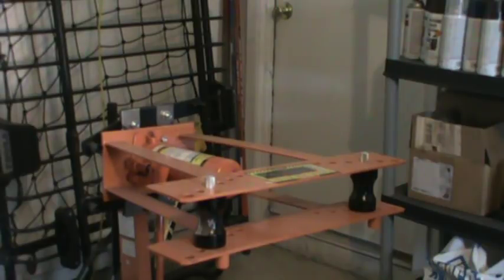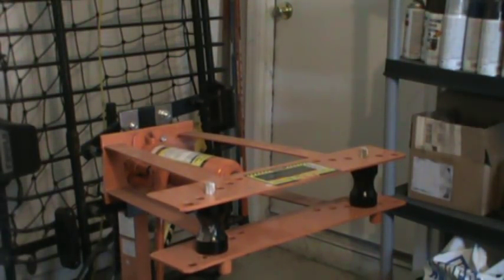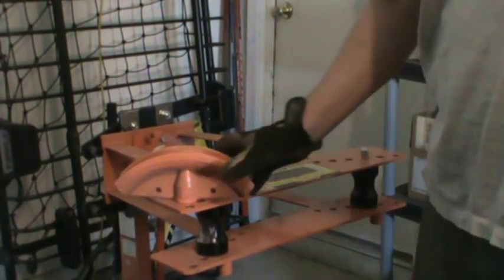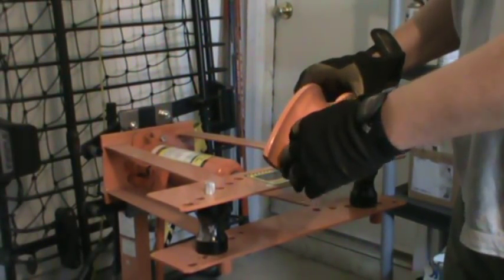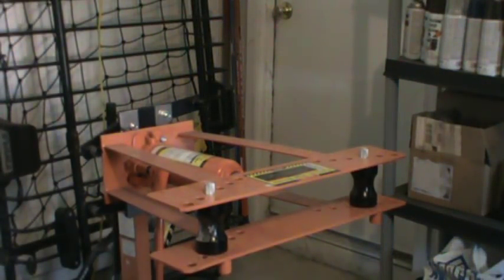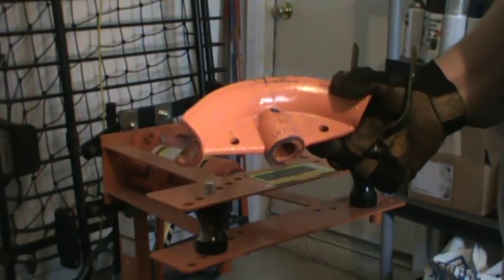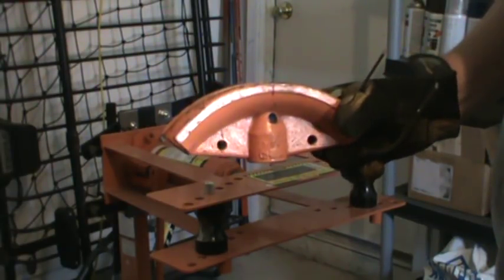A couple of the main things for making this work for anything other than just regular pipe bending. This is what the normal die looks like for one of these — pretty straightforward. What happens is the tube or pipe winds up getting compressed and actually pushed out of the die, and that's where you get a big kink. So as a modification, what we do is we actually take one of the dies — this is a one and a quarter inch die, which you can use for one and a quarter inch pipe, or it also fits pretty much exactly one and five-eighths inch tube.